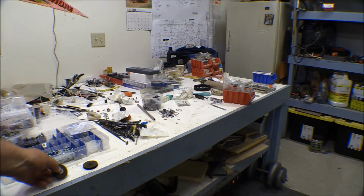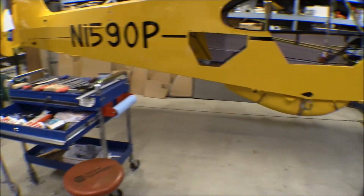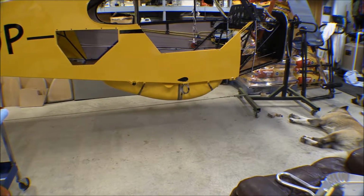So I decided to go ahead and put those pulleys on, and then route that cable out, both of them on both sides. Punch the hole in there in that grommet, put the cable through, and the pulleys are all in. Got the nuts on them. They take a castellated nut so you don't tighten the nut up, and a cotter pin in them. So I got that done on both sides. Now I didn't necessarily have to do that because those side panels are cut out to fit over those brackets for those pulleys, but it's a lot easier to do it without those in the way.